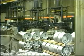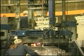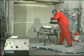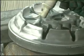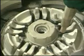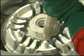Here we see another major advantage of using dry ice. In the past, aluminium gravity dies were cleaned by conventional media blasting. This meant cooling the dies, removing them to a blast cabinet, and reheating them after cleaning — a job that would take several hours and stop production of the component. Today, using dry ice directly onto the hot mold, the job can be completed in a fraction of the time without significant loss of die temperature.